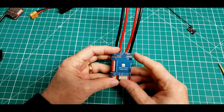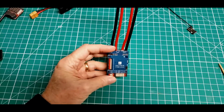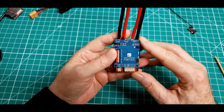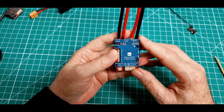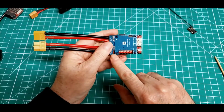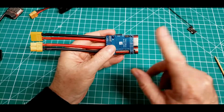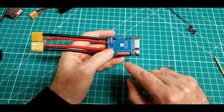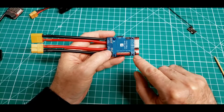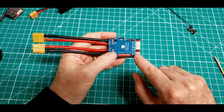This is the Matek Systems F765 flight controller board. I'm going to start looking at the ports and how to connect things to it. We saw me connecting servos to servo outputs 1 through 10. And on the H743 board, there are also 2 more PWM RC ports out here, 11 and 12, that I tested on that one.